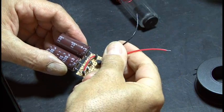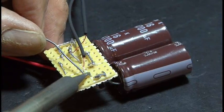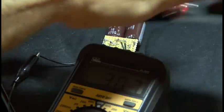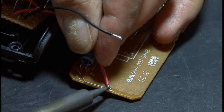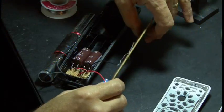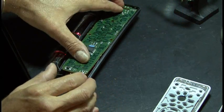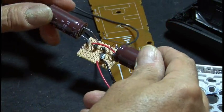Back to the bench now to hook up our new circuit to our Faraday generator. The two leads from our generator are soldered in the appropriate spots on the circuit board. A few test shakes and sure enough I'm generating over 3 volts to our new circuit. Now the final two wires need to be run from the circuit and those go to the positive and negative connections on the original remote control's battery holder. After trying to put everything back together, I realized that my circuit was not going to fit in the remote, so I had to add a couple of extensions to the caps and spread them out a little bit.